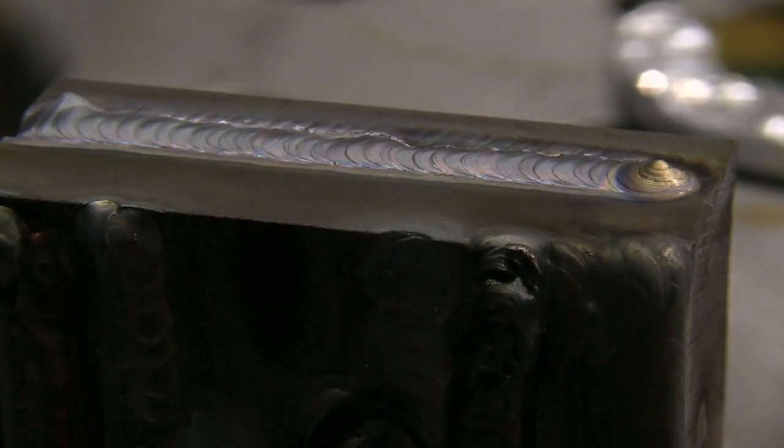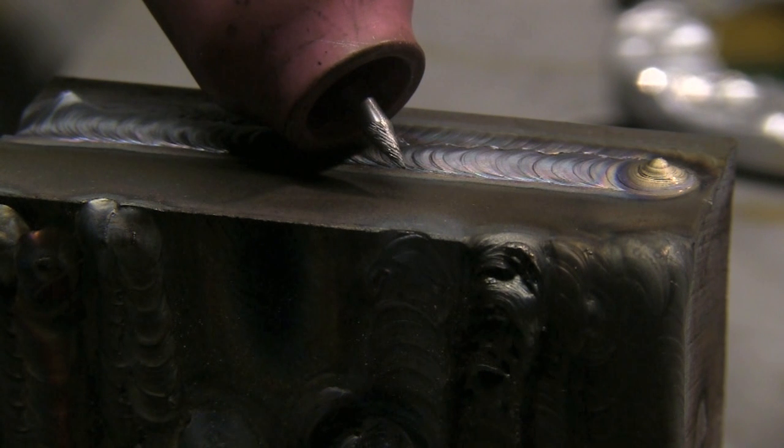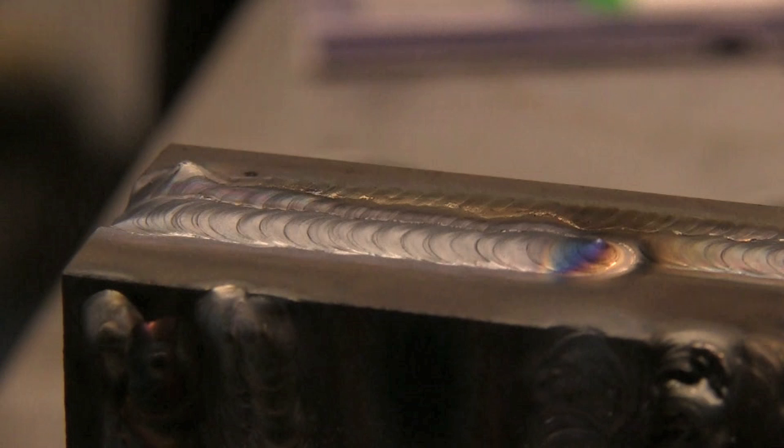Here's another application — a bead on a big thick chunk of metal that's not cleaned very well. You can see the rough scratches that aren't running perfectly longitudinally. But at 135 amps, you're not going to get much arc wandering no matter how the scratches are oriented. I'm all for best practices and doing things the correct way, because then you don't have to wonder if your sharpening method was contributing to any problems. But I also live in the real world and have seen it done a lot of ways.